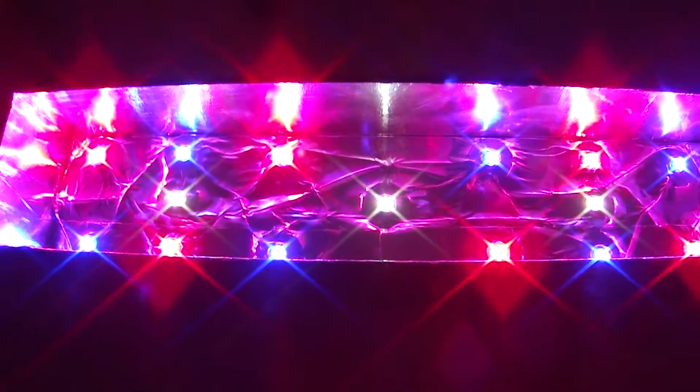Just to give you a baseline of one of our LED array concepts, if we were to actually bring one out, and I'll go into why we're not bringing it out in a second, there would be 3 times the LEDs of the actual power output of the device. So let's say we brought out a 300 watt LED array, it would actually have 900 watts of total output power, but we would cycle the LEDs at different points in the array, so that you get your full power. It still wouldn't upset your plants. You'd still get the optimal out of the plants, and you'd gain the efficiency out of the entire reflector, and also the heat management that comes into it.